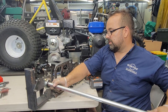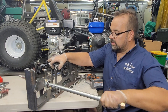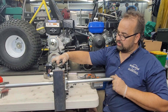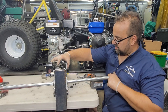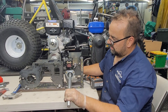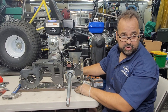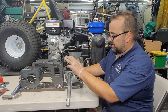Make sure there's no burrs on any of these parts. Let's work the axle in — don't tighten the bearings up until you get your axle in. And there you go: now you've got an axle mounted to your power pack bracket. It's all built on this one subframe, which gives you lots of options for making this work in your project. You will slide on your brake disc — this one is designed for a 220-millimeter rotor, a pretty common part found on Amazon, same with the caliper.